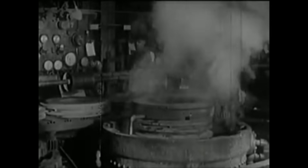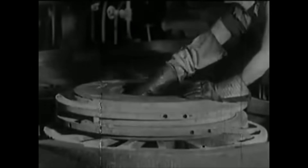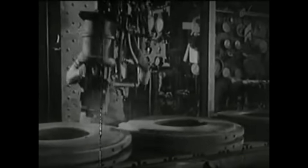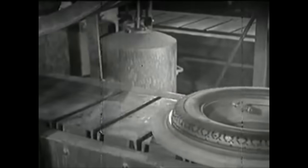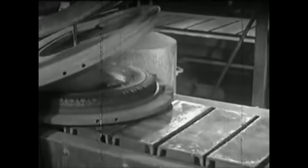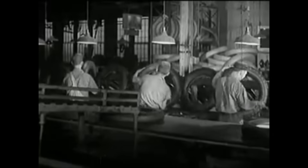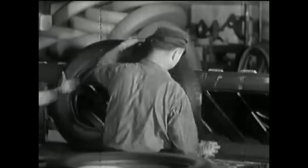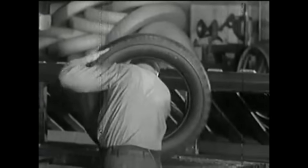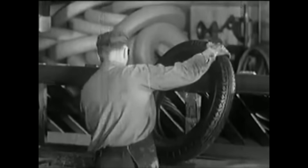As soon as the tires are cured, they're cooled by flushing the molds with cold water to prevent any possibility of over-curing. Removed from the vulcanizers to a long conveyor system, the molds are cracked open and the tires removed. In the finishing room, they're sprayed with tire paint, trademarked, striped, and balanced, then put through a rigid inspection test. In spite of the thoroughness and the constant check during each phase of manufacture, every tire is thoroughly inspected inside and out — no blemish or imperfection is overlooked. Every tire must check with the exacting specifications set by one of the most outstanding groups of research engineers and chemists in the industry.